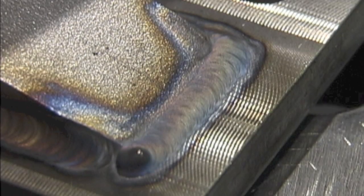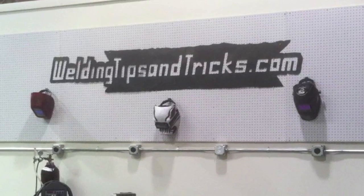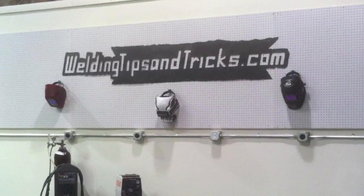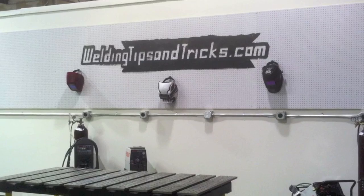For this little weld on the end there's not much room; one little seal pass is about all it'll accept — no matter how much you build it up, there's only so much metal there. So I did a little lay-wire technique there too, using just a little more amperage and pushing the rod in to keep that wire from balling up. That's the slider job. If you're on my web page watching this, make sure to scroll down and watch the second video — it's a plug for a TIG finger. It's a good video on welding some aluminum beads. Thanks for watching, visit WeldingTipsAndTricks.com.